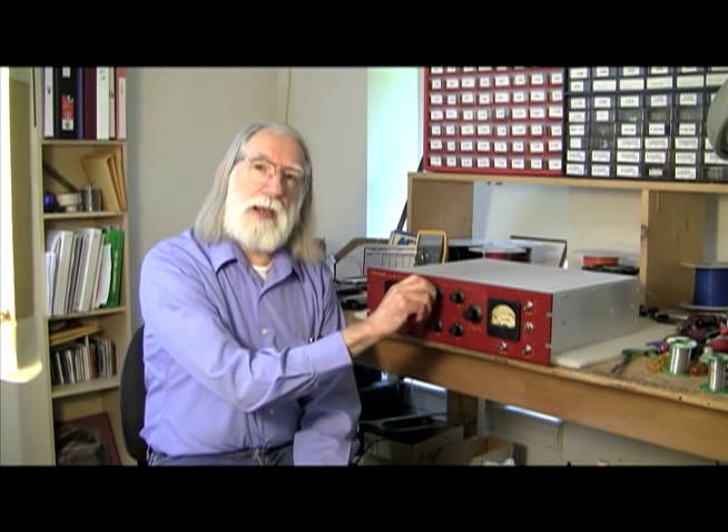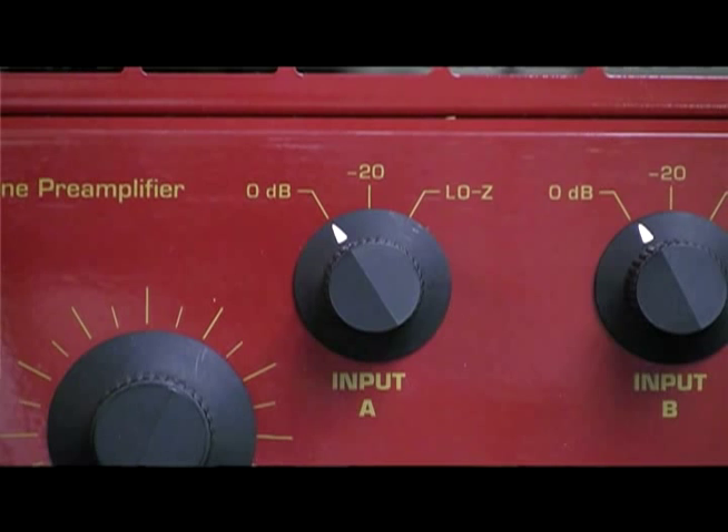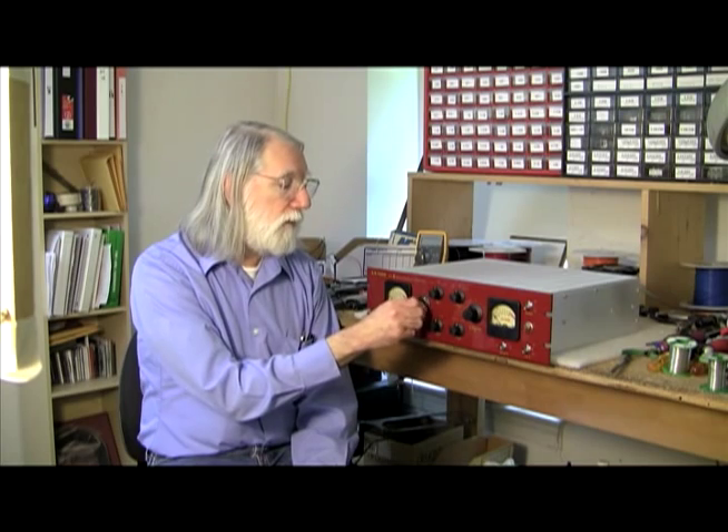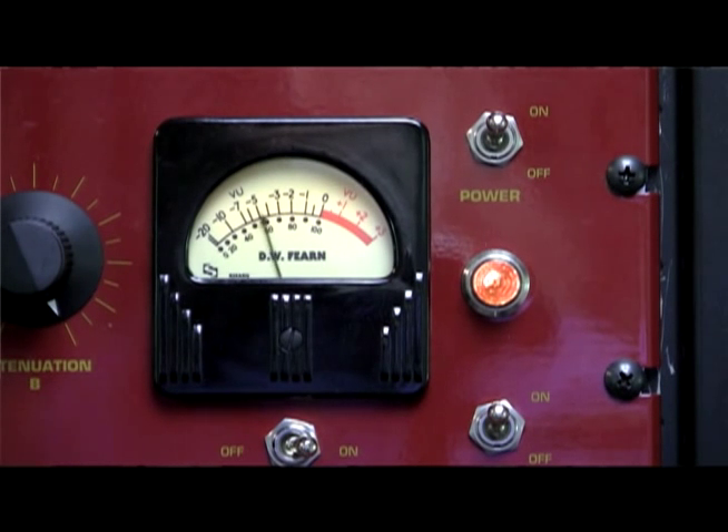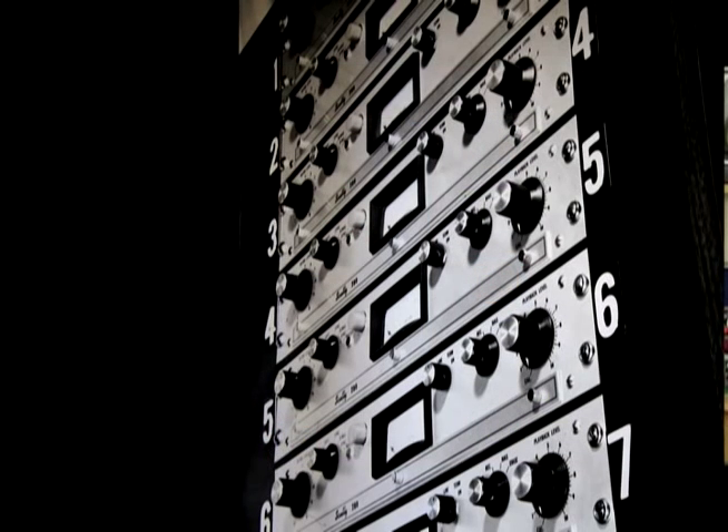Now, regarding the overall level to send to your recorder — in the days of analog, sending signal to a tape machine, the indication shown on the VU meter on the VT2 corresponded pretty well with the dynamic range of the tape. Peaking the signal level so it was approaching zero but hopefully didn't go above zero very much was the optimum level for the recorder, maintaining the best signal to noise ratio and utilizing the dynamic range of the recorder to its fullest.